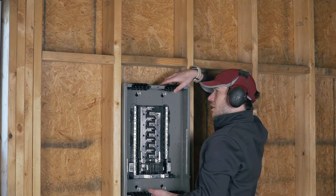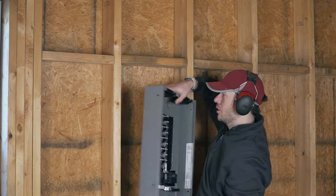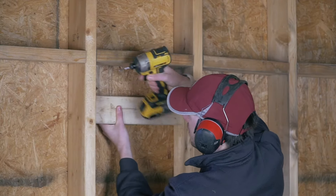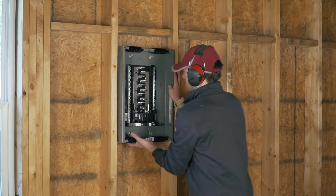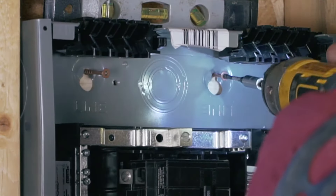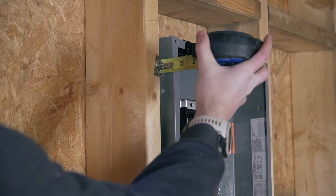The holes are right at my three-quarters of an inch, so it's not going to work. Thankfully there's always another way — if you add blocking between your wall studs you'll be able to use that to connect the back of your panel to it directly. Definitely verify that your panel is sticking out by the right amount because this is actually a code requirement.